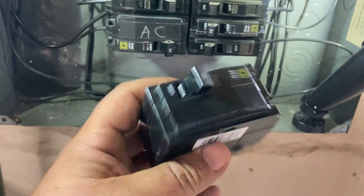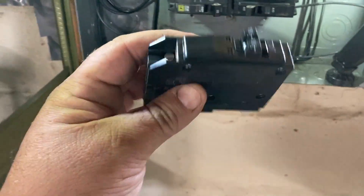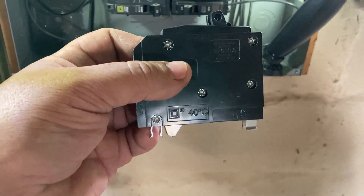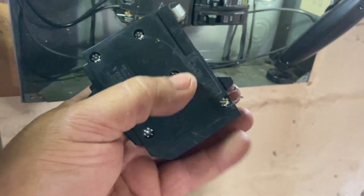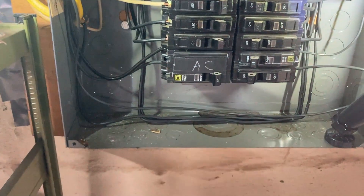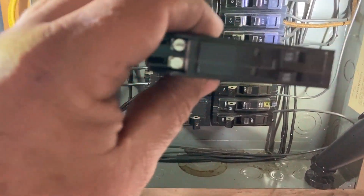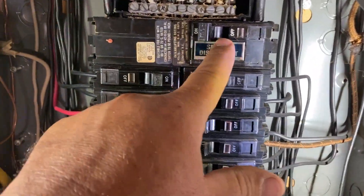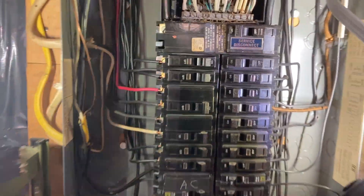This piggyback breaker is about $14, and this 30 amp breaker may be $65 because they still make them but they're really hard to find — a lot of people have upgraded. The newer ones have a hook and big plastic piece for CTL — circuit total limitation — so you can only plug in so many throughout the box in certain places. The idea is they don't want people just putting bunches of them in and overloading the box, though you'd still blow the 100 amp main breaker.